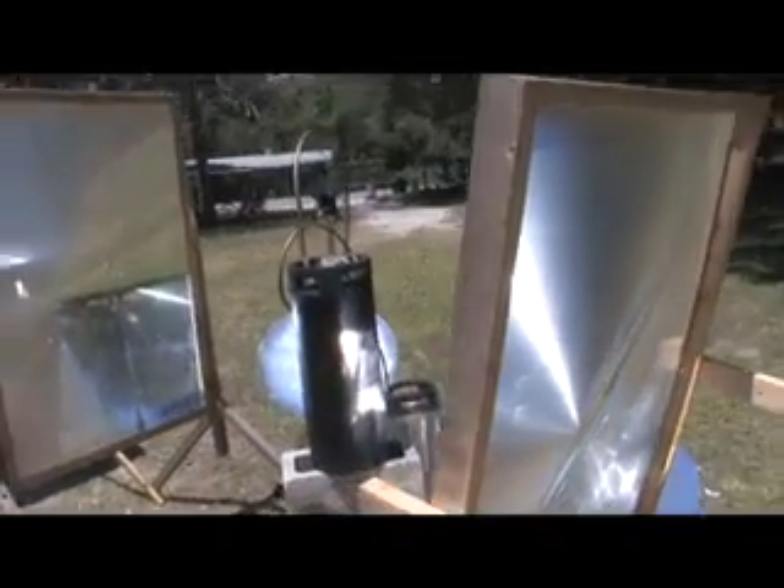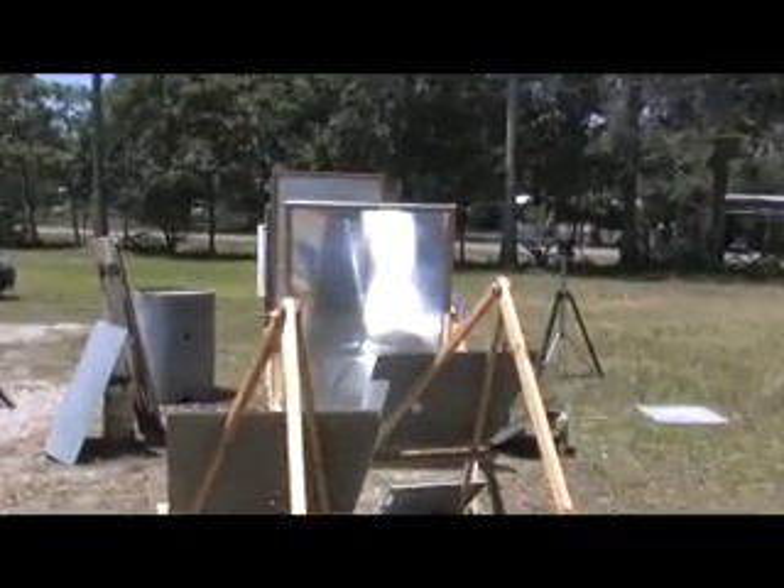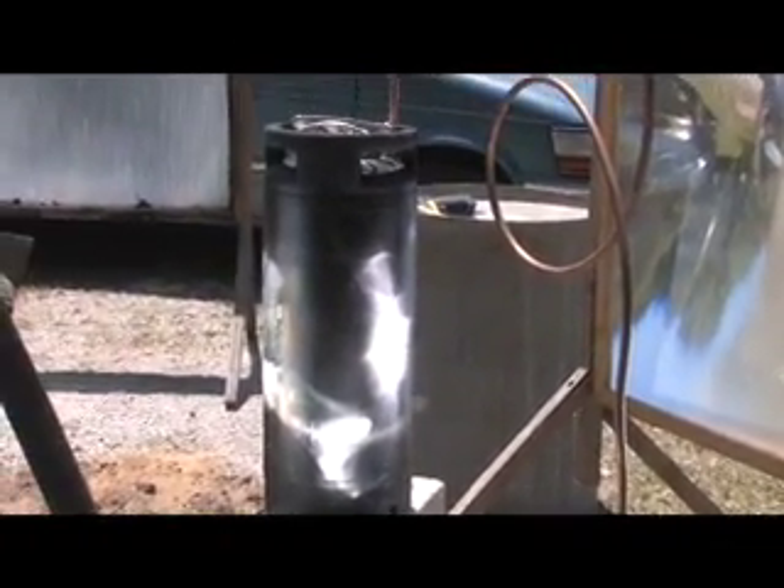We've changed our approach a little. This Fresnel lens, with the sun practically right overhead, isn't getting a nice side fill. So we've taken all of these mirrors and arrayed them together to go through the Fresnel lens. Now we have four spots on this side measuring 250 degrees — instead of barely 200 degrees before when the lens was catching it at an angle. Now we're right on target. We've made some readjustments. It is ridiculously hot outside.